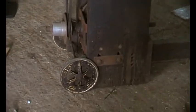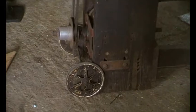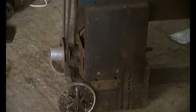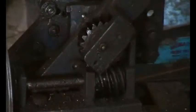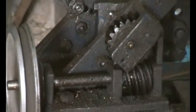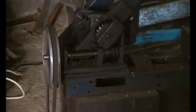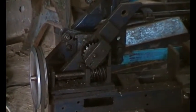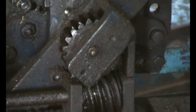Otherwise it would be big lumps of metal. There's the motor, and wheels off a child's toy or something — probably 1930s wheels, or even earlier. Pressed steel with a rubber tyre. And the thing we were talking about in the video were these worm gears — there's a worm and pinion gear there as a secondary reduction. So you've got reduction between the motor and the first pulley, then reduction there again. It was just use what you've got — the ingenuity of it. And on the end of that pinion there's a grease nipple — in America they call them zerks.